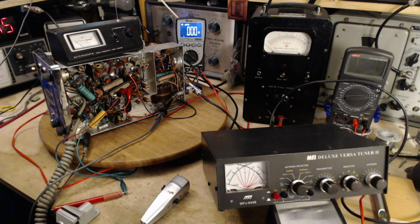Now, did it say keep it at 22 or no higher than 22 or no lower than 22? I'm just going to take a peek myself. Here it is. Connect the test equipment. Keep it at 22 or less. Whichever gives the most output. So you're adjusting this network, trying to get the maximum output while holding the plate current, to be specific, at 22. So I would have to work out what kind of voltage should be on the 100 ohm resistor with 22 milliamps or less, while I fiddle around with those other controls.